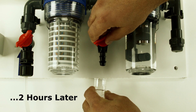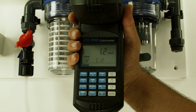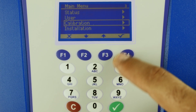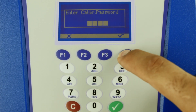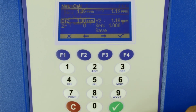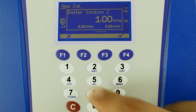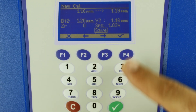After 2 hours, take a water sample to measure in your photometer and check the free chlorine level. Go to the calibration menu from the main screen. Your password is 4-2. Choose the new calibration section. You should see a raw value close to the reading value on top of the screen. Enter the value that you read on the photometer in the field shown and save it.